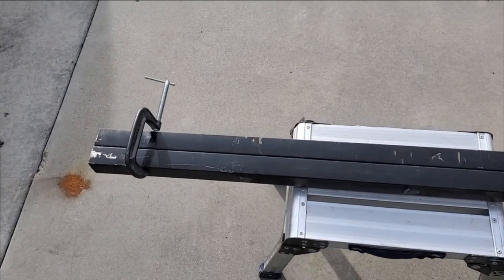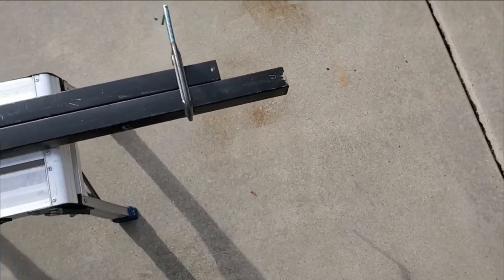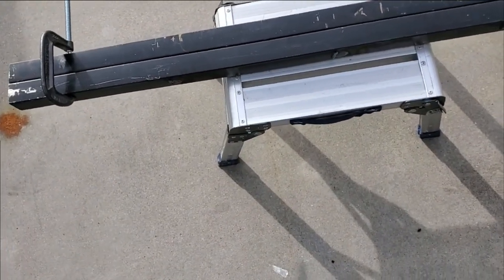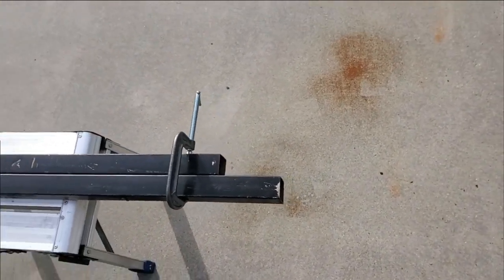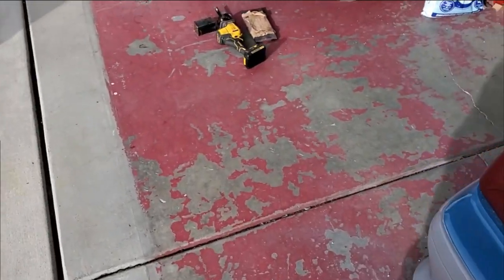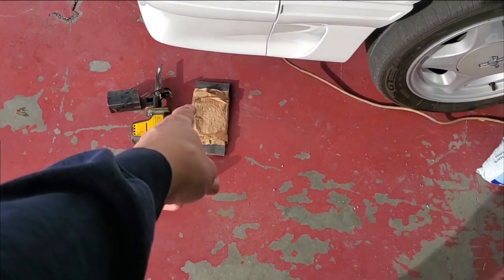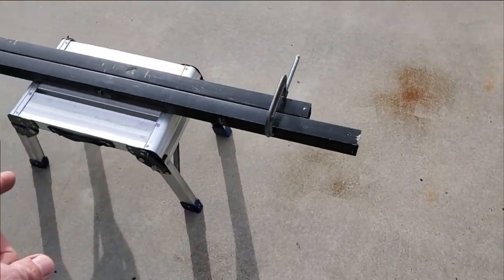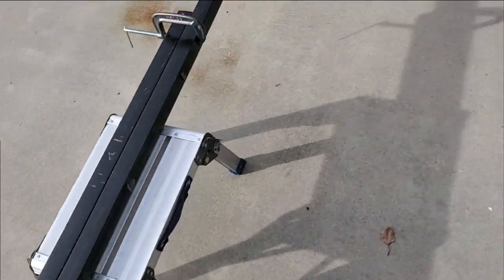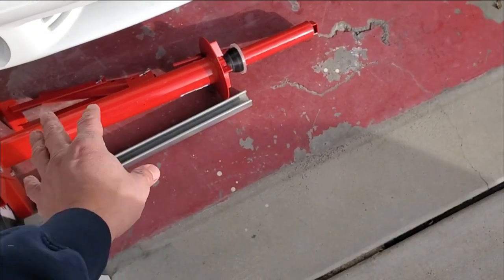It's a few days later and I've done what I explained — I cut that off. This is the part going in the receiver. I'm gonna run some weld along that gap to get those sealed together, not necessarily a solid bead all the way down. Then I've got these two plates — that's what I cut off the one end. One plate is going on here, I'm gonna slot it before I weld it on, then weld the other plate on the back of this.